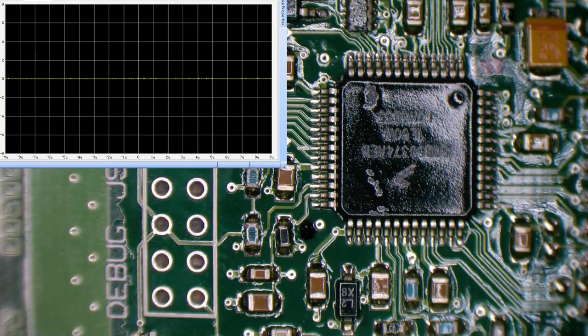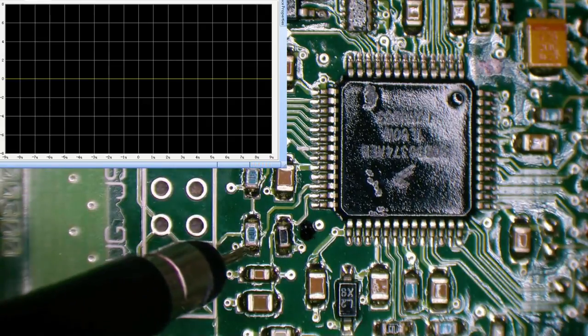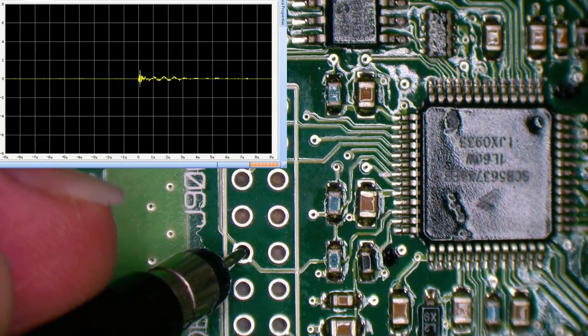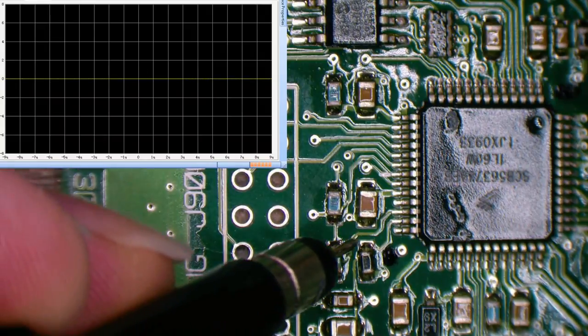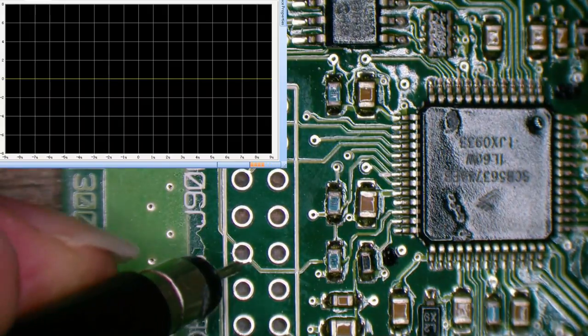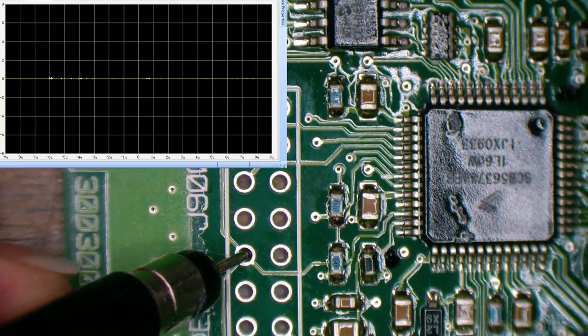All right, let's probe the reset pin. What did we say it was? 24? 26, 25, 24, which comes off. Oh, we can use the debug to probe on. All right, let's go back. There we go. So you can see pin 24 snakes its way through under here to our debug header. So we can probe on that and see if it's in a reset state or not.